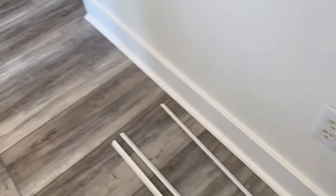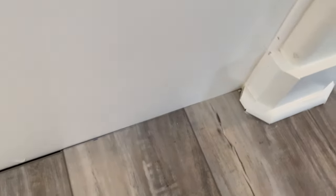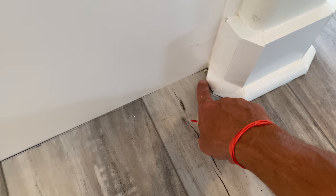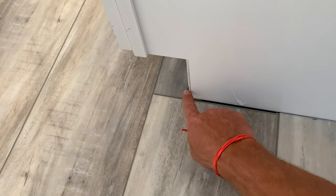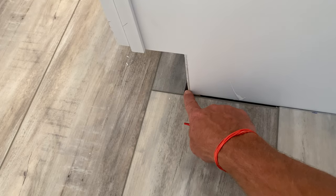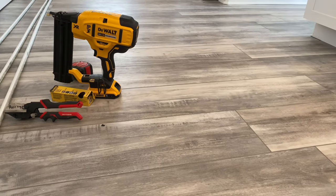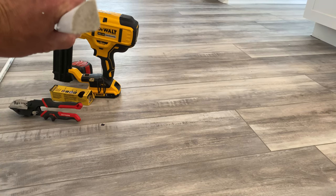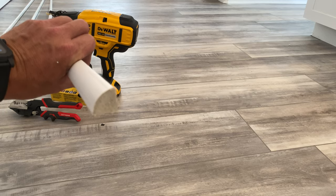Basically you have what's called an inside corner and an outside corner miter. We're going to start out with an inside corner miter — that's going to be a 45 — and then on this end it's going to be an outside corner 45. The first thing I like to do is take the end of my trim, figure out which direction is up and down.